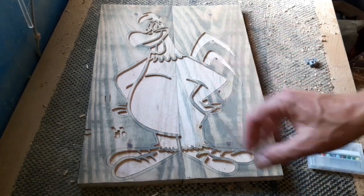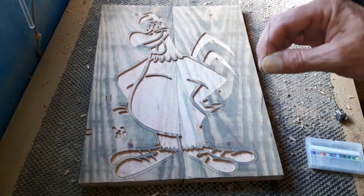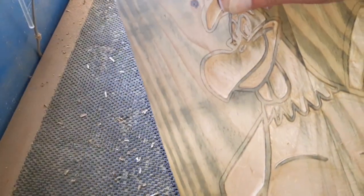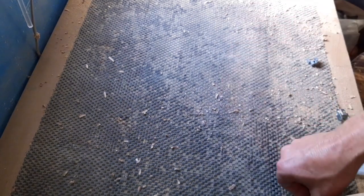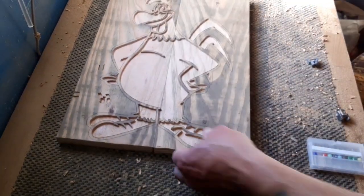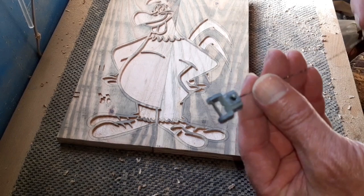If you're doing a delicate piece, there's another blade, it's the same effect, but it's pinless, so there's no pins on it at all. These are ideal if you're doing very detailed work with inner cuts. Imagine you want to cut out this little section here. So you've drilled a pilot hole, you've fed that in, and we want to cut that out. That's no problem with that one. Whereas if you come in with a pin blade, you'll find those pins just get in the way. So pinless, pinned, or spiral for me. Unfortunately, with my old Draper saw, I do have to use these adapter clamps.